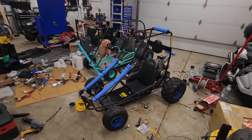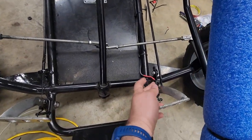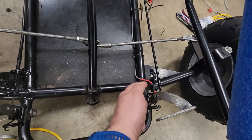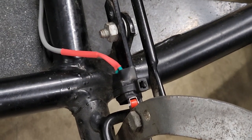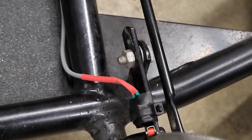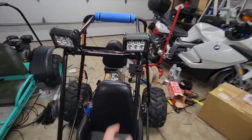How's that for some practical prints? My only concern is how well this is going to hold up. I did put the switch on there with a zip tie and some VHB — basically it's VHB, then I wrapped it in electrical tape, and then put a zip tie around here. When I pull the brake pedal you see the switch opens. Keep it simple — got two wires going to the back, positive comes up, and when it goes back it turns the light on.